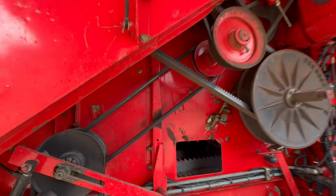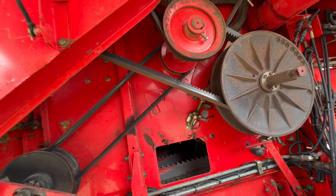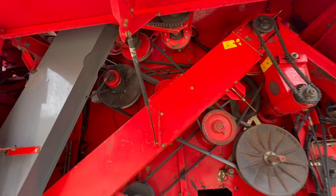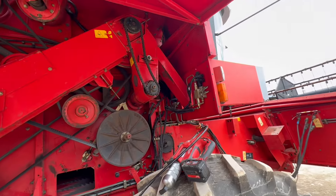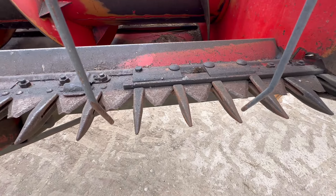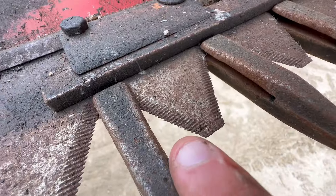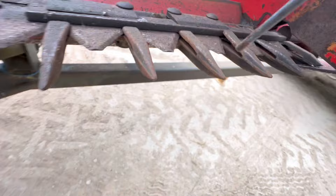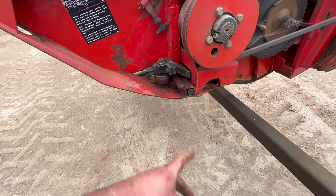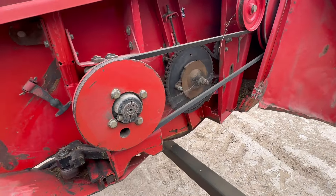We've got loads of stuff to go around here. What's this belt looking like? It's okay but not amazing. We do like to keep on top of everything. It's a bit of a minefield trying to remember what does what, but I've done it that long now you just sort of know off the top of your head. Also these knife sections — that one's all right, but that one's a bit worn. See the difference? So I've got to pull the knife section out, undo this, slide the whole thing out, and re-rivet new sections of knife in. But we'll do that next week.